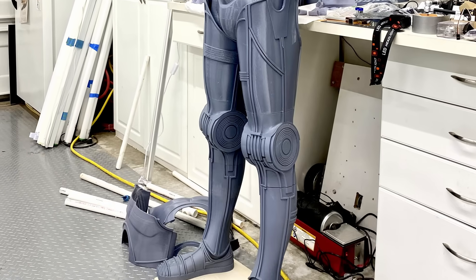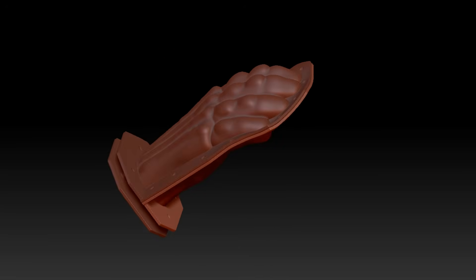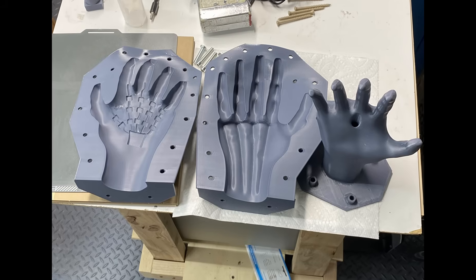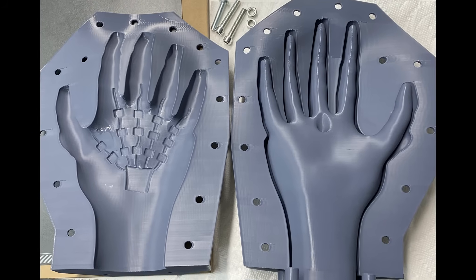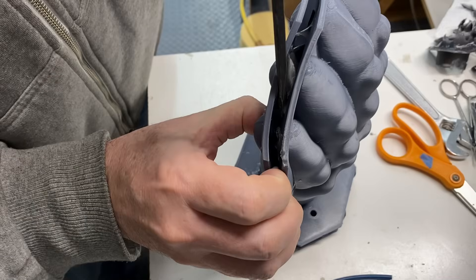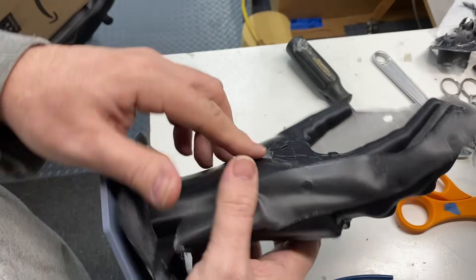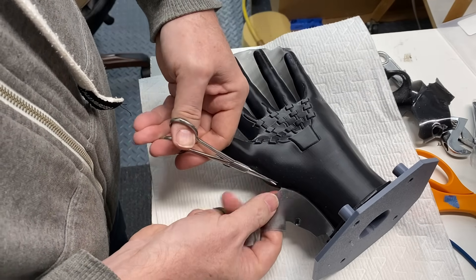I was really happy with how it was all going, so I moved on to designing the animatronic hands. I wanted to try 3D printing molds to pour silicone into. This would provide me silicone gloves to fit over the mechanics. Once the molds were printed, I bolted them and poured in some very soft silicone. While that was drying, I printed all the little nurnies for the hands and fingers. After a few hours, the silicone was cured and ready for demolding. After some gentle prying with a screwdriver, the molds opened to a really cool glove. I spent a little time trimming off the flashing from the edges where the molds meet, using a pair of cuticle scissors.